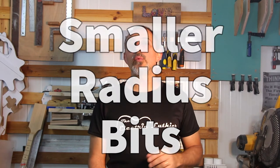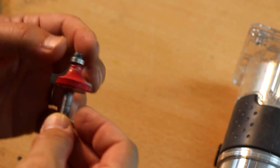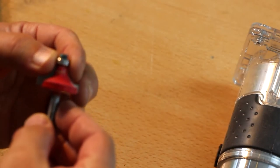Let's start with the small one. If you're not binding the guitar and you want a subtle rounded edge — just a bit more than you'd get by sanding the edge — this is the one. This little bit will give a nice subtle edge. To maintain this roundness, you'll probably not want to sand it with grits smaller than 220.